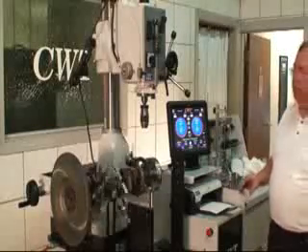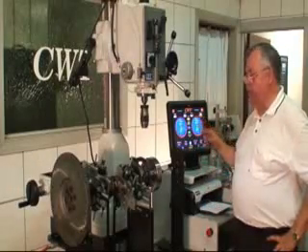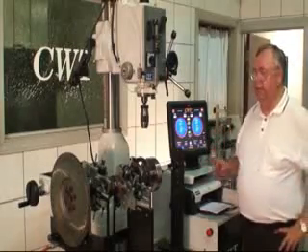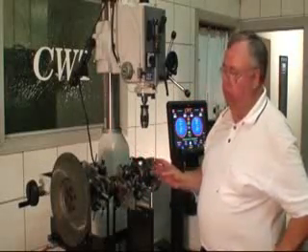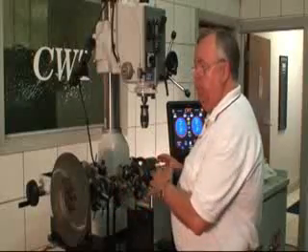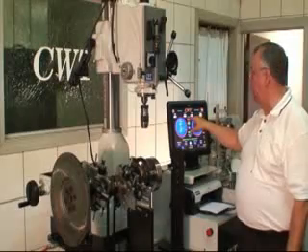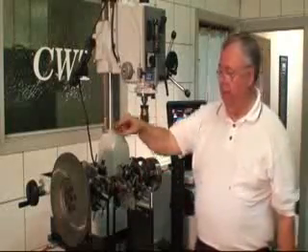What's important here is I'm trying to show you the advantage of three-plane balancing. The last time the left side was 13.66 grams; right now it's 13.64 — just two hundredths of a difference. Over here, we went from 19 grams down to 4. We made a 15-gram change without seeing a change on that side. Competition machinery gets confused by this because a two-plane balancer assumes the two planes are working in harmony when in fact they are two individual planes. The third-plane analysis allows us to totally separate these two, so it recorded the change without affecting the other side.